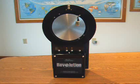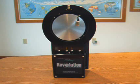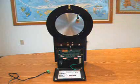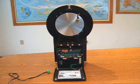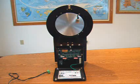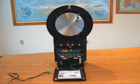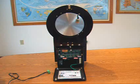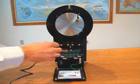Installation is complete. I will now demonstrate how to properly set the controls for the torque and power output signals within the master control unit. I will now connect power and verify basic operation of the system. The TorqueTrak Revolution accepts either a 12-volt DC or 110 or 220 VAC power supply. Typically, in a permanent installation, the power is routed in shielded cable up through the knockouts provided in the bottom of the enclosure. For demonstration purposes, I will simply connect the power directly through the box opening using this green 3-pin connector provided with the system.